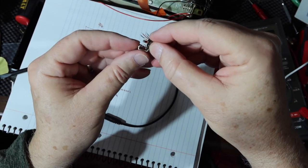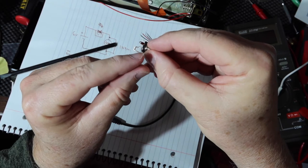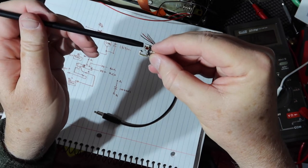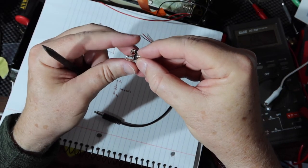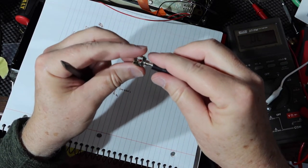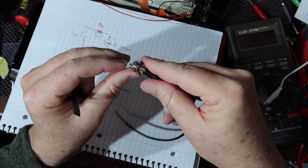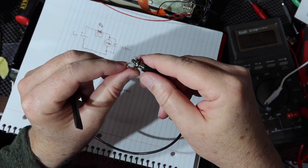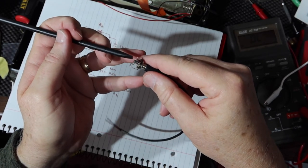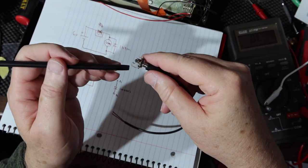And here you can see that little switch that takes place. You might not be able to see it, but it's making contact now between this leaf and where the tip will rise. So if I put a plug into there, maybe you can see what happens. Now, see if I can get this on the camera. You can barely see it, but these two points separated right in here. So the little S-shaped piece, which touches the tip, is actually the common.